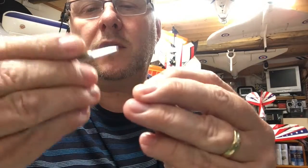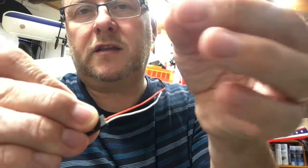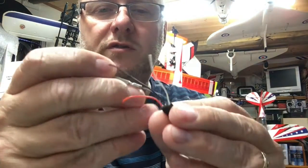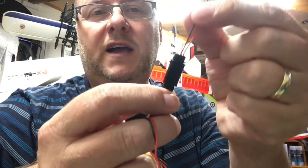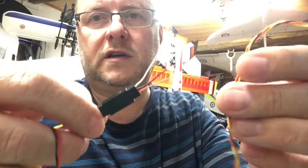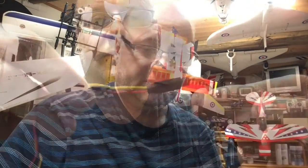If you don't know how to get the pins out, what you do is lift the little black tabs — lift them up — and then when lifted up, the wire will come out. That only goes in one way. If they don't fit, sometimes you need a little jeweler's screwdriver just to poke them in the last little bit, and there should be a little bit of movement. The yellow wire is going to be where the white wire is — colour it in with a felt pen if you want — and black and red are the power supply. All you have to do is cut these wires and join them onto those wires, and then you've got a lead ready made up.